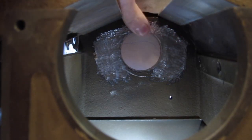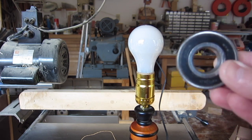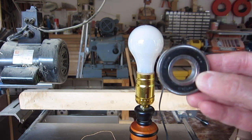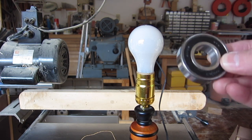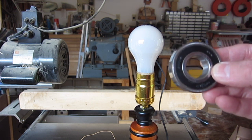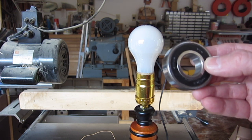By doing a little grinding with the Dremel tool around here, I've knocked off the high points. That gives me another 50 thousandths of an inch clearance — probably did much more than I needed to, but it gives me a good comfort factor that the blades won't be too close to the casting. The bearing can be hammered onto the shaft of the cutter head, but bearing manufacturers recommend that the inner part of the bearing be heated up so that it expands and you don't have to use as much force, avoiding the risk of deforming the bearing or the shaft.